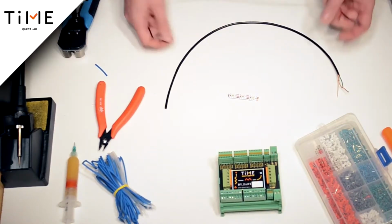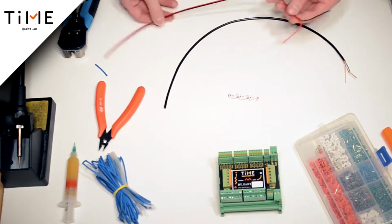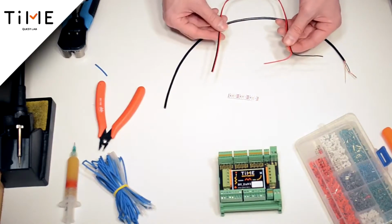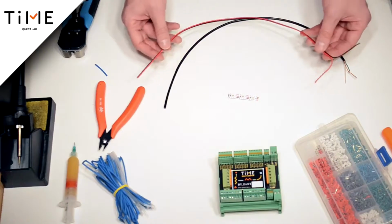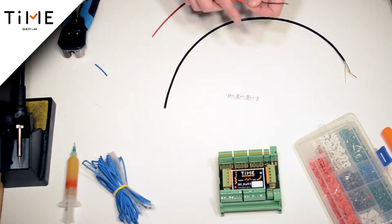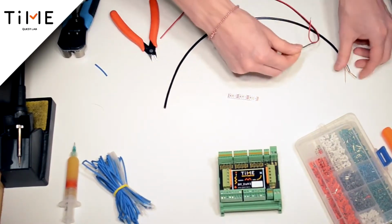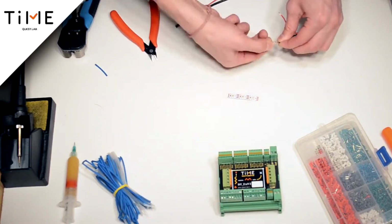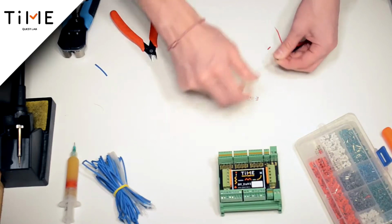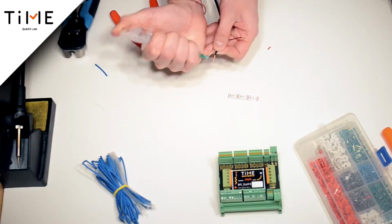How to connect the tape to both the signal cable and the power supply? It is necessary to bring a cable with a characteristic thickness of about 0.75 square millimeter to the tape. To bare its wires, and it is necessary to connect the signal cable to the ground minus, so that the ground of the power supply and the ground on the controller were of the same type. To do this, you must tin it.